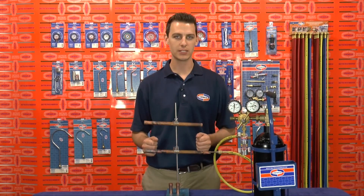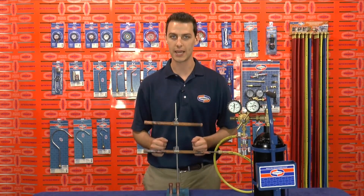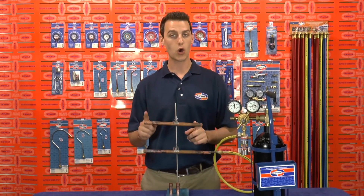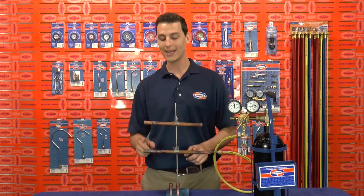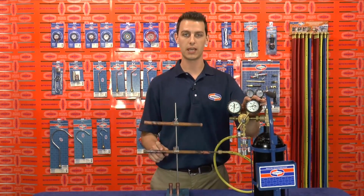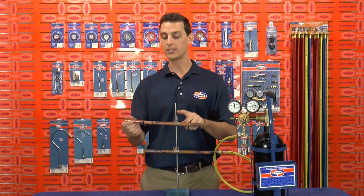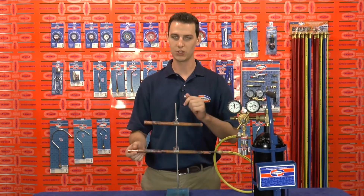Now I'm going to show you how to braze a copper fitting together with Nitrogen flowing through the line to prevent oxidation and the resulting scale. I have two pieces of copper tubing set up here. My top tube is open at both ends and exposed to the ambient air, and the bottom tube at one end is open, the other end is closed with an access fitting brazed into it. Attached to that access fitting I have the Nitrogen tank. So we're going to braze two pairs of copper fittings together, one on the top tube and one on the bottom tube with the Nitrogen flowing through it, and we'll take a look at the difference.